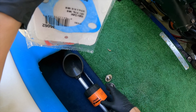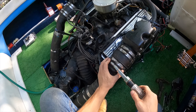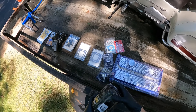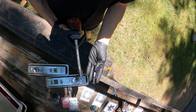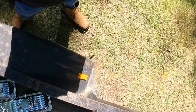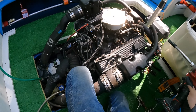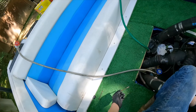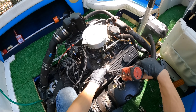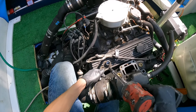Is this a slug? There's a slug in here! So we're going to go with a 10 millimeter here to take our valve covers off. It's gonna look pretty gross in here. She's already got these manifolds loose, otherwise you would not be able to get to this 10 mil right here if you didn't take your manifold off for your wet exhaust.